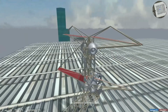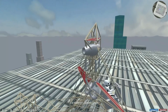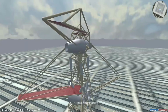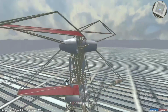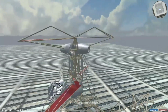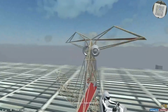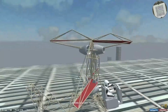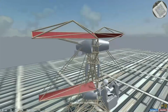But when I went to tilt to the sides, a big problem emerged that I was definitely going to need to deal with. So the top part of the swash plate with those 4 rods that are just vertical is swinging back and forth quite badly. It's just not very well secured. Now what this is going to result in is most likely the swash plate just straight up not working for tilting side to side and up and down, because as the blades are rotating around, they need to be influenced very, very quickly by however that's tilted. You can actually see here specifically how this part is swinging back and forth just a little bit. That should be completely rigid.